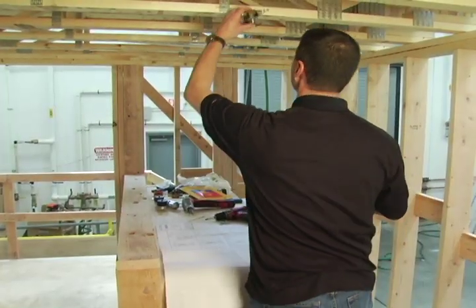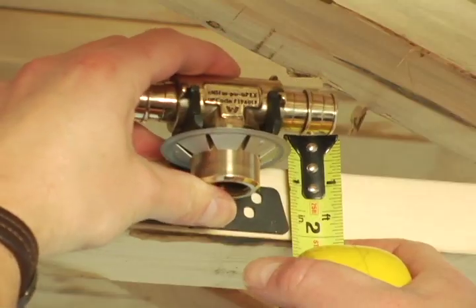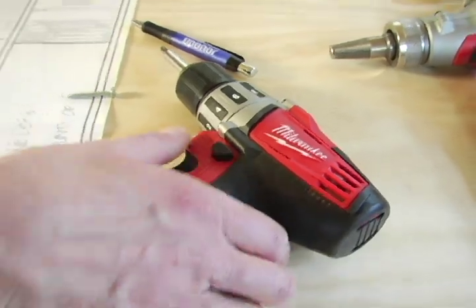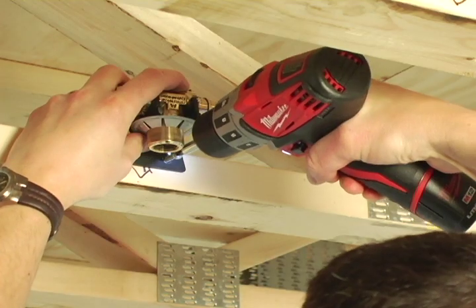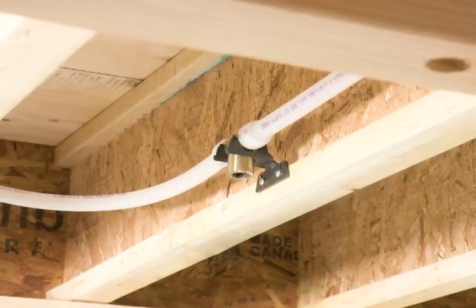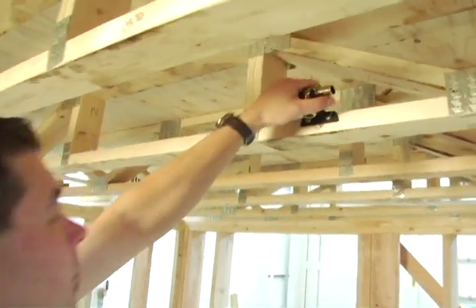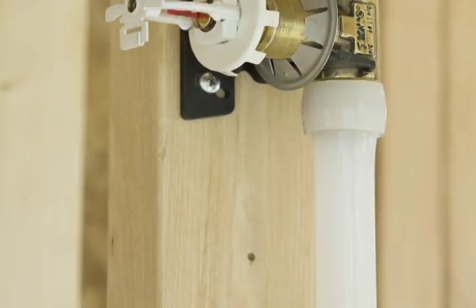Position the adapter, ensuring that the vertical location takes into account the thickness of the material that will be attached to the ceiling or wall. Using number 10 screws, securely mount the adapter assembly to the ceiling joist or wall stud. Uponor's innovative bracket design allows the adapter to be mounted on a variety of joist and truss types. Our sprinkler adapters are specially designed to secure the sprinkler in place so no further strapping or hangers are necessary.